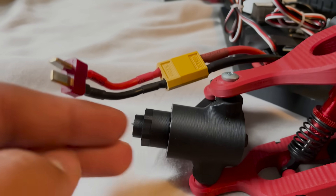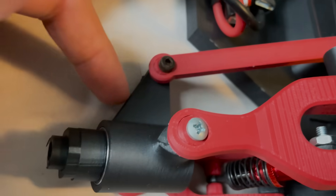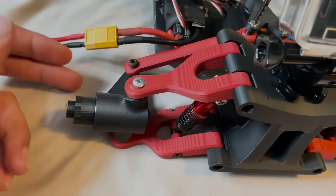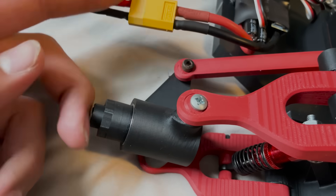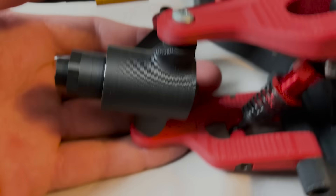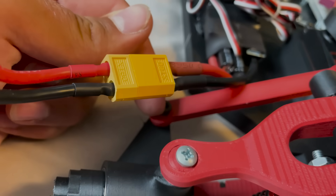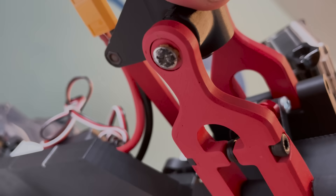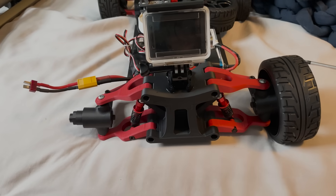The wheel has to sit in closer, and the reason I had to space it out so much is because of the geometry of this control arm — this setup was made for the old wheels. So I was trying to avoid doing this, but I guess there's no avoiding it. I'm going to have to change the geometry of the steering hubs to make the control arm link over here instead so the rims aren't hitting it. It barely did any damage where it skidded — just scraped the end of the screw a little. Going to redesign that now.